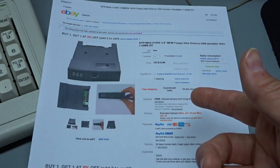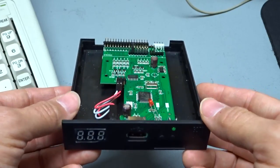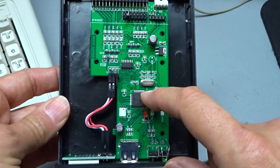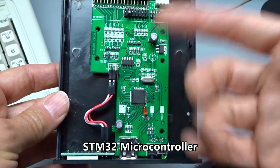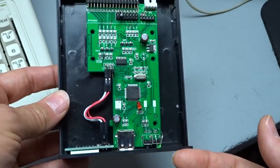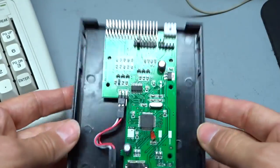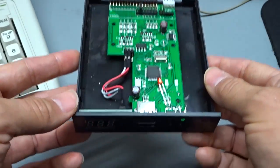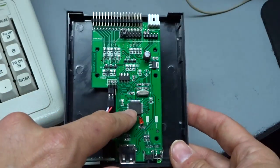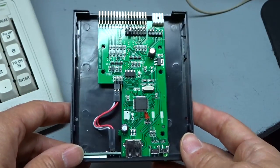But that's actually something you can do — you can order the cheap one like I did and upgrade the firmware. I've removed the cover of the emulator. Right here is just a standard ARM-based microcontroller, and whatever firmware is on here is basically converting from a USB thumb drive with floppy drive images on it to the signals that the floppy drive needs. Someone has come up with new firmware that does a lot more than the original.